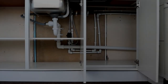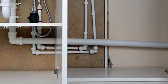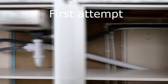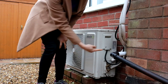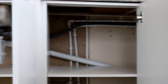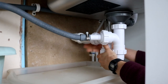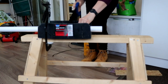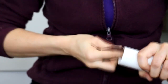Then it was time to work on the waste pipe so all that grey water could lead outside to the drain. I didn't realise there was such a thing as self-cleansing pipes, which means the gradient shouldn't be too steep or too shallow because water flows through quicker than food. For my first attempt I just got a long piece of pipe and took it outside, pushing it through the existing waste hole into the cupboards up to the waste trap. Now I'm skipping to where I started making adjustments. I had to cut a slightly longer piece of pipe using a cutting block and hand saw, then removed any burrs with 240 grit sandpaper.